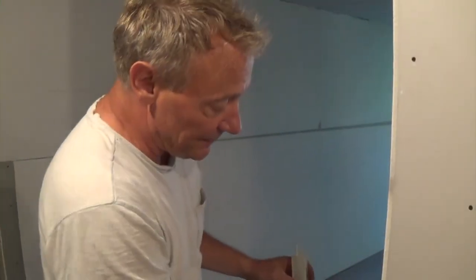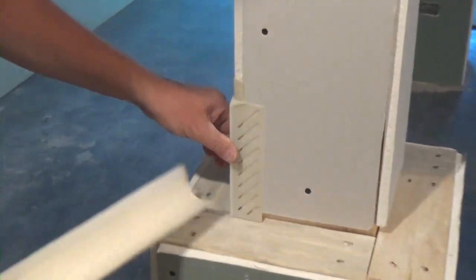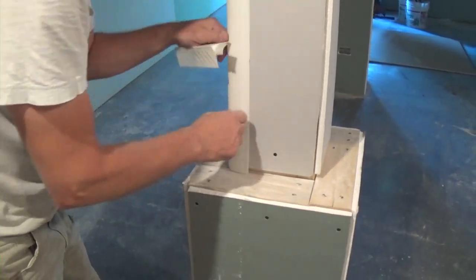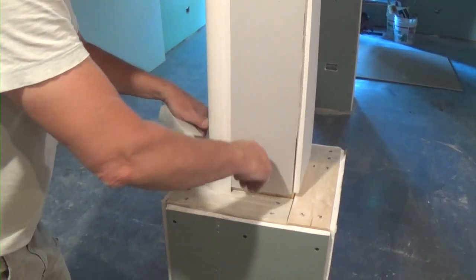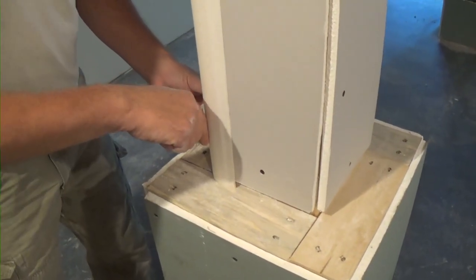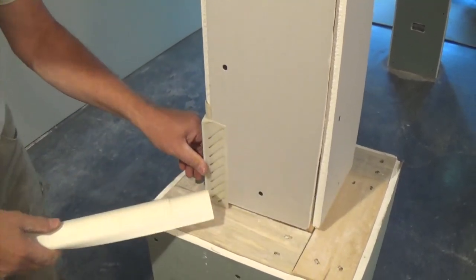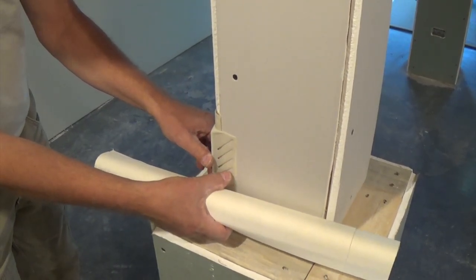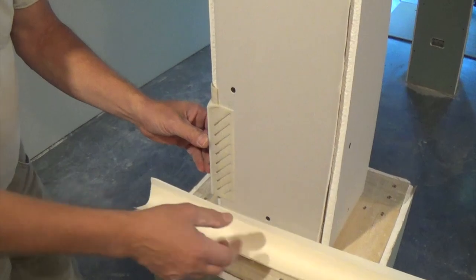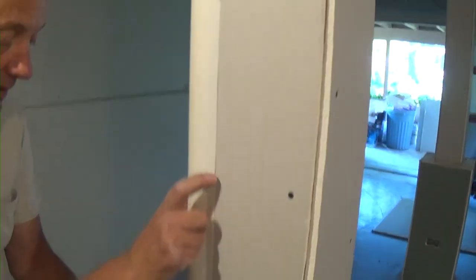The bottoms — sometimes if this is the floor, and you're going to put a piece of casing on here, the casing is going to come straight but you have bullnose here, so the casing can't come straight. What they do make is these little plastic tabs that slip into the trim. When they trim this out, there'll be a big gap here, and they make these little plastic pieces that you caulk in and slip right into that gap — those work really well, if you know how big the trim is. If it's really small trim, like two-and-a-quarter, you cut this thing down. But if it's big trim — five or six inch base — I've had to hold them up off the floor to make sure I'm above it, and then that goes right on top.